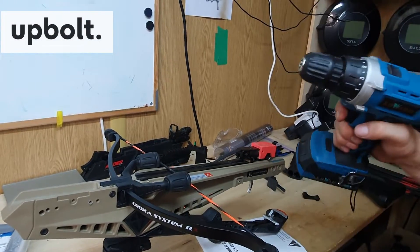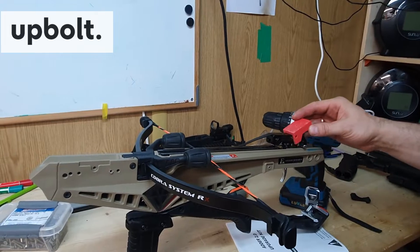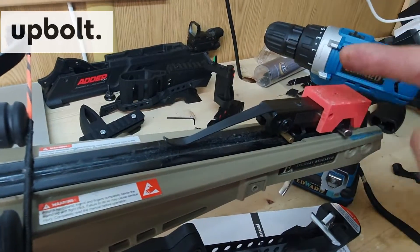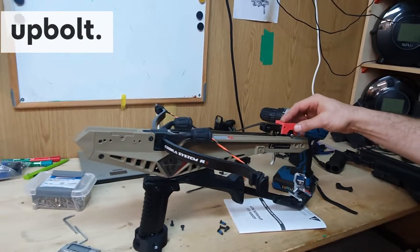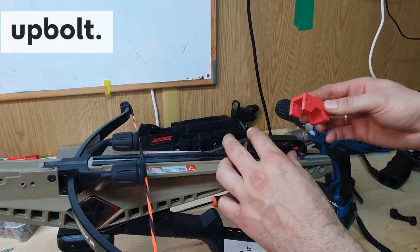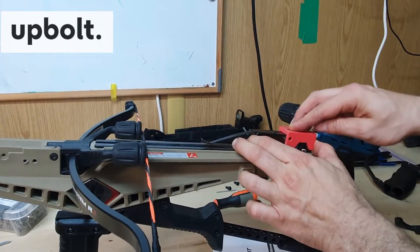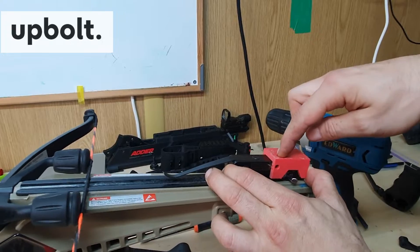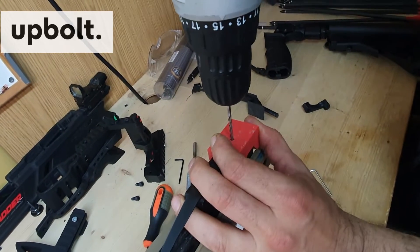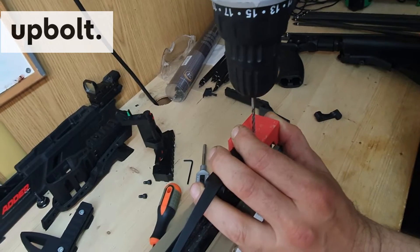What you're going to need is an electric screwdriver to drill the holes. My recommendation is first to place this plastic item, prepare the drills, fixate the plastic item, and then cut the metallic part. The plastic part will serve as a guide for when you make the cut. Pay attention that there are two surfaces — vertical and horizontal — so you need to align both. When you have aligned both, this plastic item sits correctly so the hole is in the right position.